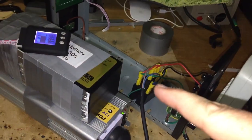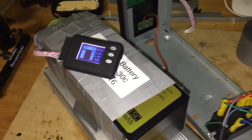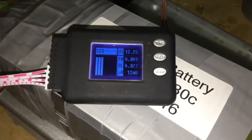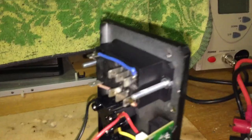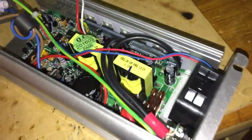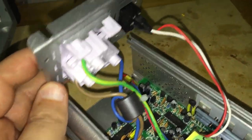When I unplug the power, the relay will click and the battery will fire up the inverter — just like that. You can hear the inverter kick on. The batteries are now pulling 211 watts and the printer is unaffected. I've just mounted the relay, and the battery BMS is mounted to the battery as well. Here's the 600 watt inverter.